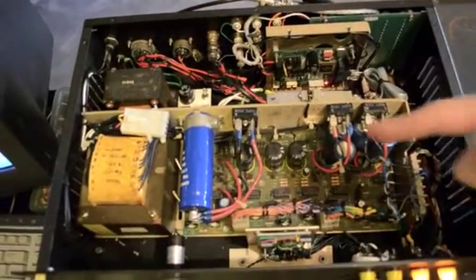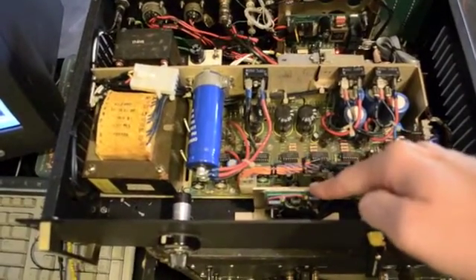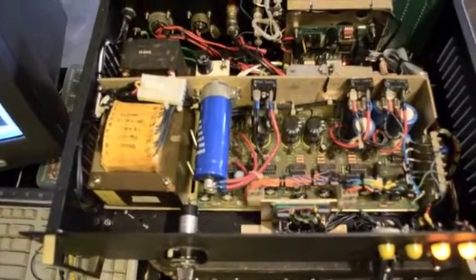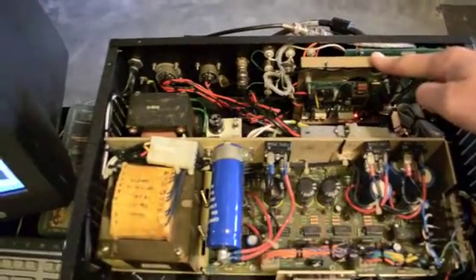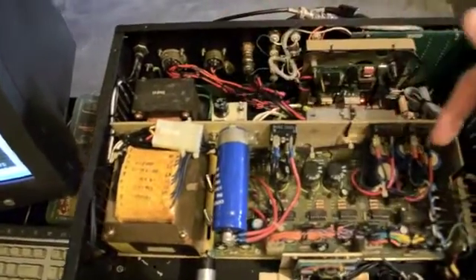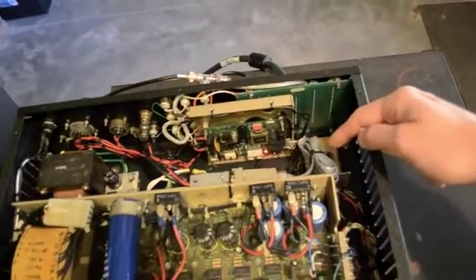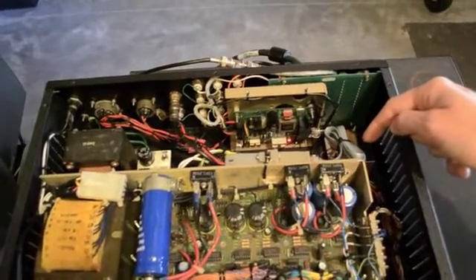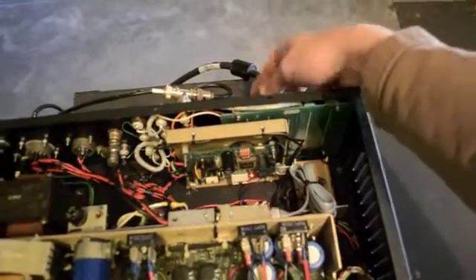Inside you see a DC power supply here — linear. This is the ramp generator, an analog ramp generator which is triggered digitally by the PCI 6014. Back here is a stepper motor controller for the linear rail. This is the power supply for the linear rail — switch, fuse, rectifiers. This is an active low-pass filter for the DAC output, in case we want to use that to modulate the YIG oscillator. Back here is a breakout board from the cable that goes to the PCI 6014.